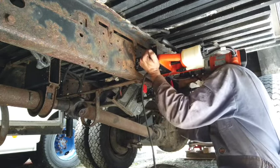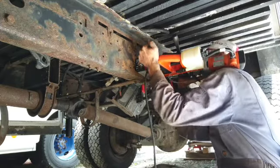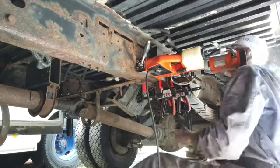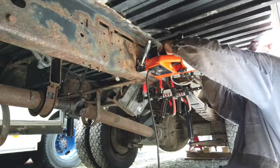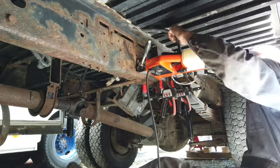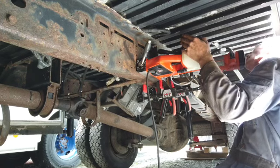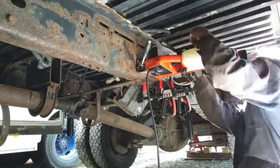So you may notice I have a new drill chuck on the mag drill, silver. It's a regular drill bit chuck adapter that fits into the chuck of the mag drill. So this meant I could use a longer drill bit, and now I don't need to do the process I did on number three jack, where I drilled a little bit, then I bottomed out because the chuck hit my channel. Now I've got lots of clearance. I can drill the hole all the way through. I can drill two of the holes all the way through here. That has saved me a lot of time.